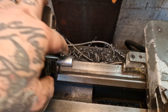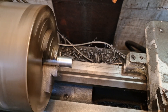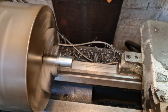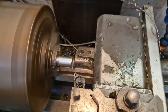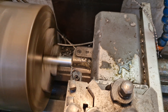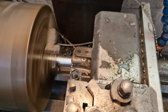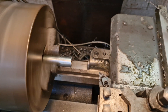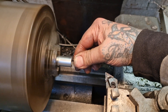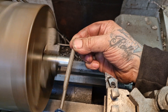So we'll do that. I've found some tube - nice thick wall. Just changed my speed. The 3/8 bolts fit up lovely, so I'm just going to face it off so it's nice and square, then break that inner edge and the outer edge with my file.